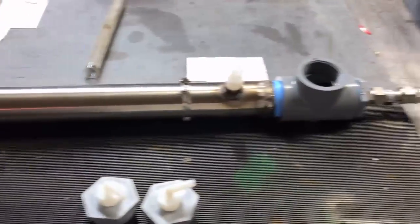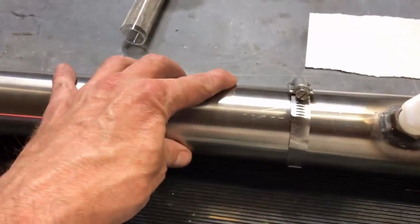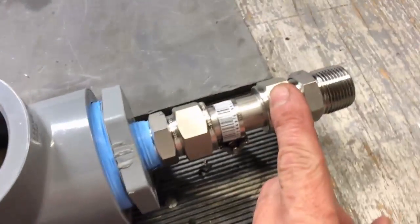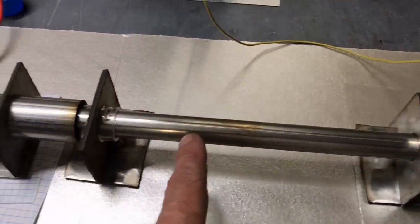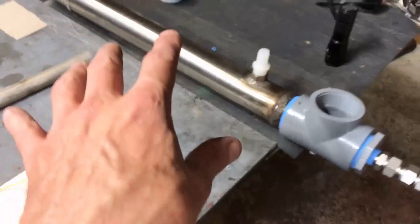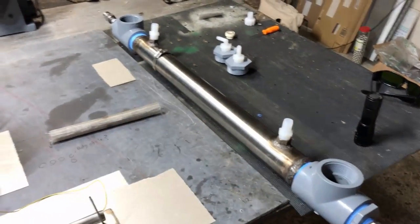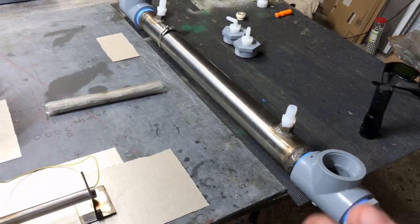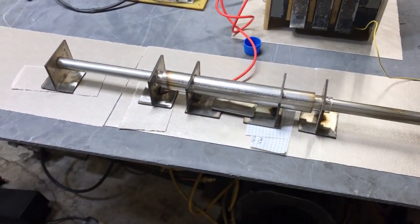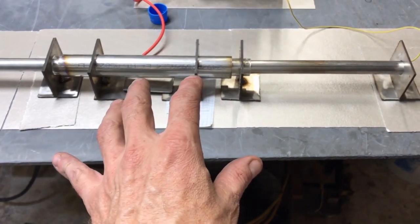This is just a single cell of a multi-cell unit, but this is a dual cooled water jacket. You have the exterior water jacket and also the interior electrode which will also have coolant running through it. We're going to want to get this thing down to below zero temperatures, using an antifreeze of some type for the circulation fluid. We want to keep this thing as cold as possible - heat kills ozone, so we don't want the generator getting hot.